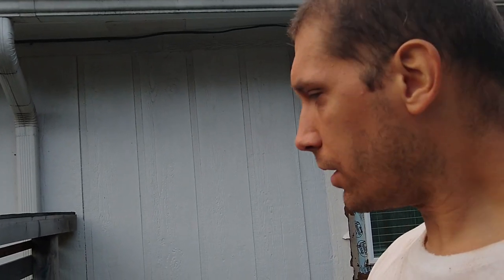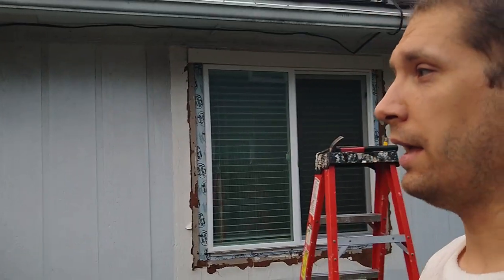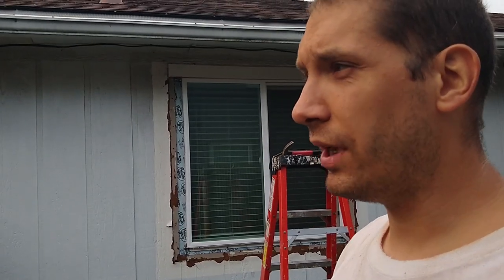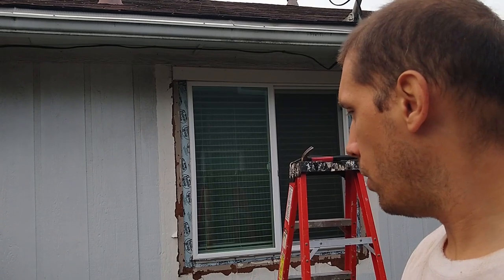So to have proper foundation for the Hardie planks, we are gonna install brand new sheets of OSB boards all the way around. And after that, we are gonna use the Home Shield from Lowe's. I prefer the 3 foot wide ones, because they are much easier to work with. So this is the job today.